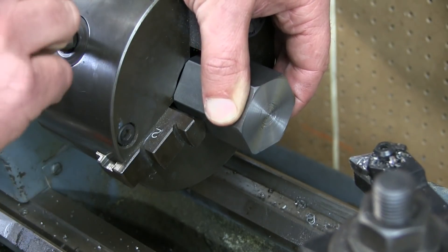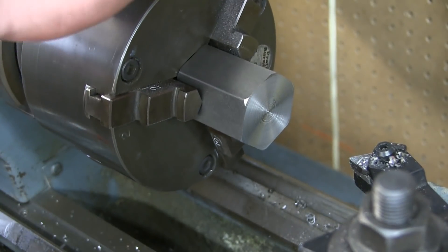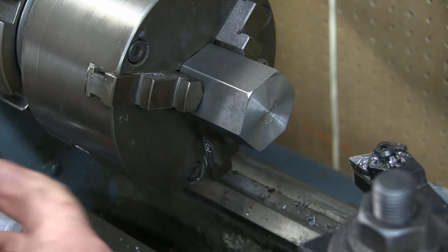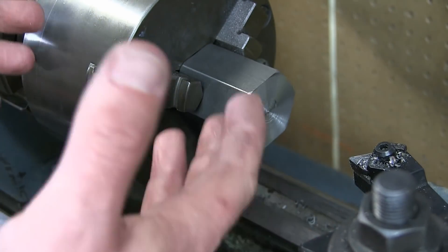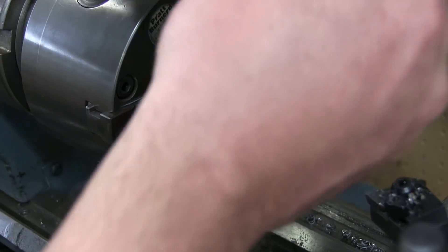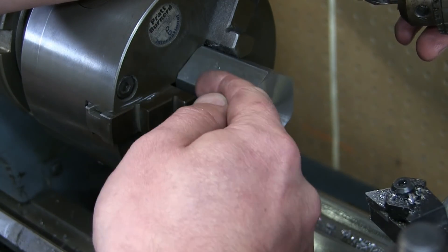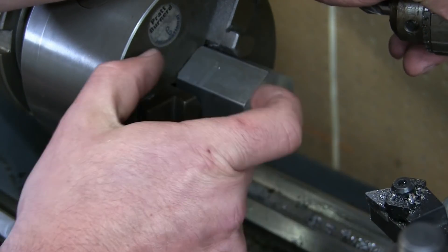We're going to do it a different way here and take a new direction. I'm going to use the queen of machine tools — it's the only machine tool that can replicate itself, at the hands of an experienced operator. Not me. The zombie apocalypse is coming; you're going to want to know a guy with a lathe. We're going to center drill this, then through drill it three-eighths, and then we're going to try broaching it. Now it is a deep broach, so we might come in from the other side around halfway with a bigger drill so that the broach doesn't have to work all the way through this big slug here.